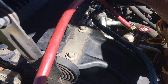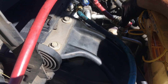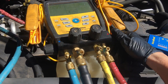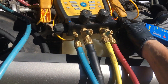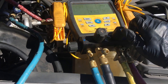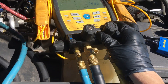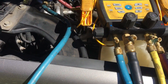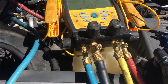I went in reverse order — first I turned off my couplings on my fittings to isolate the hoses, and it would not pull down into the microns. Then you isolate one side — sometimes it will, and that means it's that hose. Then I turned off the other side and it still would not go down into microns. So it just won't go — that is oil contamination on the micron sensor.